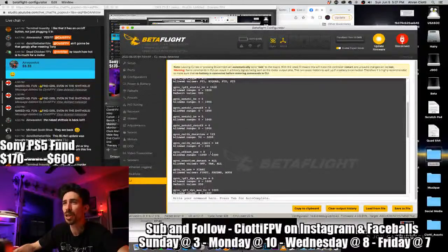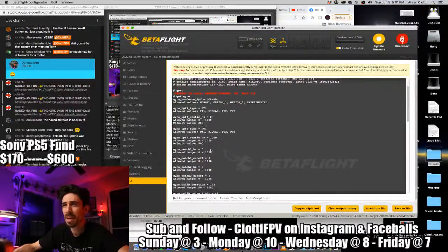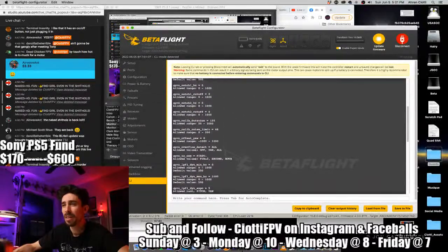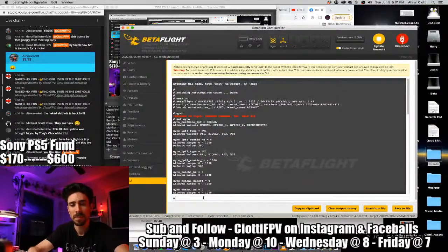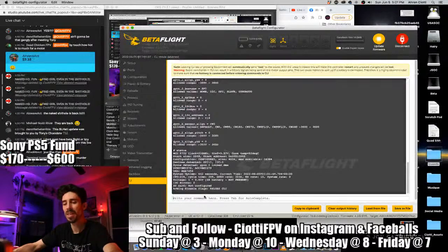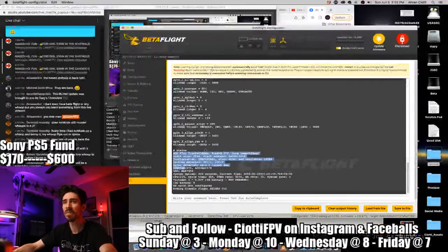So I just typed get gyro, and that's pulling up everything with gyro in it, but it does not look like it's telling me in here. Status, that's what it is. Thanks, NM. So status is the CLI command that will tell you all of the interesting stuff. Gyro is detected. Gyro 1 lock DMA. Gyro BMI 270. There we go. So BMI 270 is what we're going to be looking for in the presets.